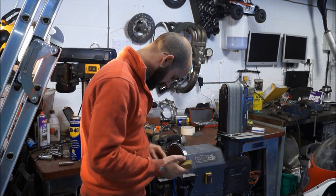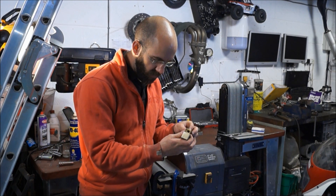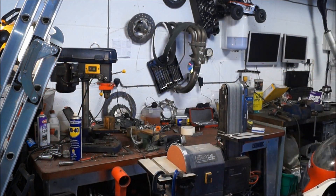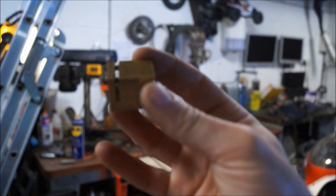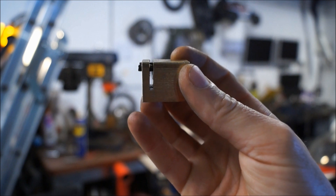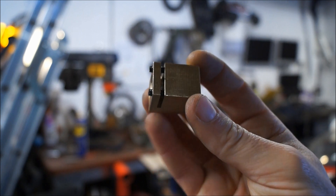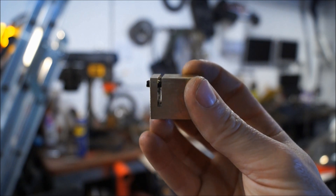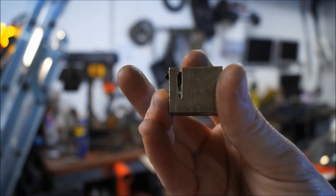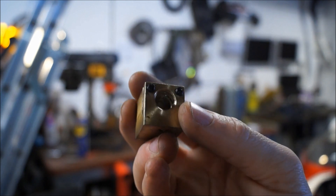What I'll be able to do now is trim it off. I might even make it slightly longer than this one — there's nothing in the way, and the more thread I've got, the more thread there should be supporting the lead screw. I'm tempted to change the design as well, because this one uses a split design with a pair of small set screws to take up the slack in the threads — you just tighten them up, it separates the two pieces of thread and just pulls against the lead screw. I'm tempted to try and make a sprung setup using a spring and a second piece, which should give some sprung tension against the threads. I'll have a think — I've got springs and stuff I can do it with, it's just deciding the best way of doing it.